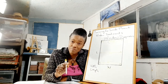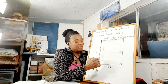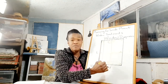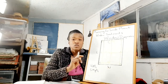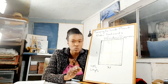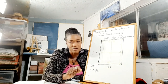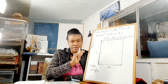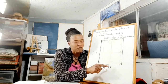Now you do the same for your length. You measure the right side, you measure in the middle, and you measure the left side. Always take three measurements. Don't assume your window is 100% square. Do your three measurements — width first, length next — and then take your smallest measurement from your width and your smallest measurement from your length.